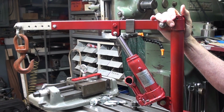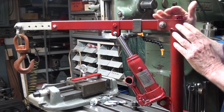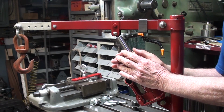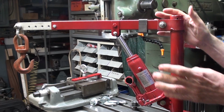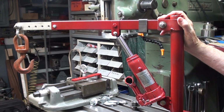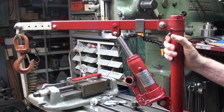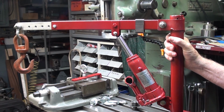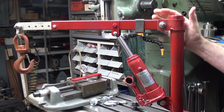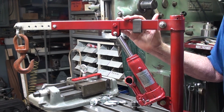Do you recall in part 1 of the original video on this crane that I wanted to actually put a winch on here. It would be a fixed boom, forget about the jack, and put a winch on here. And I did all kinds of research on that. I was going to use a boat trailer winch, but you know, they aren't good for lifting, they're good for pulling. They have a single pawl on them. They can get away from you, although someone told me you can get winches with a double pawl. I was unaware of that, but I was most pleased that I got a comment from someone saying, why don't you use the tiny winch that they use in a pickup truck to store and lower the spare tire. I think most of you know what that is.